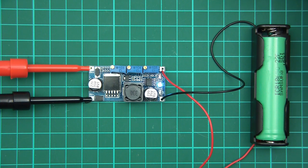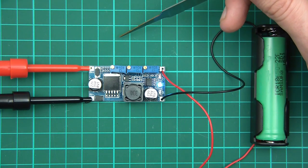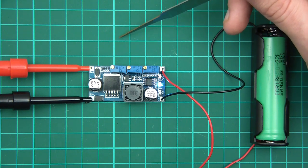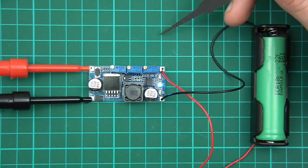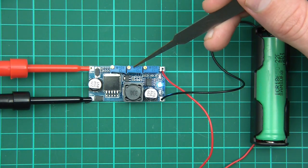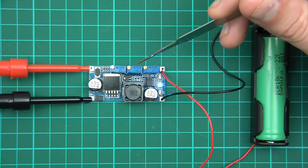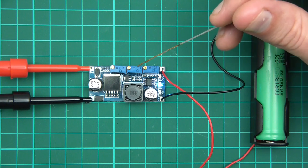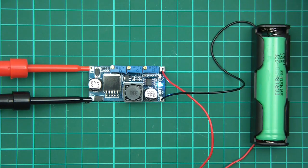As a battery charger, you'd do the same - give it a high voltage input, set the voltage carefully. For a lithium-ion cell you want 4.2 volts, or different voltages for other chemistries. Then set the current level - I tend to use 1C, around an amp, for these cells. Optionally you can use the third potentiometer to set the OK LED threshold, though it's not 100% clear how to configure that level. For me it's just been trial and error, setting it for one battery and assuming the same level for others.